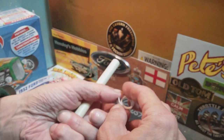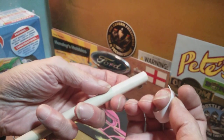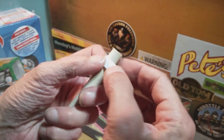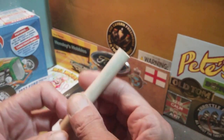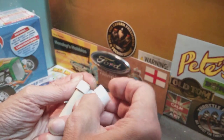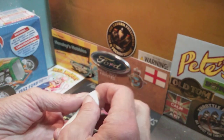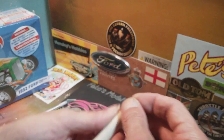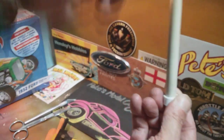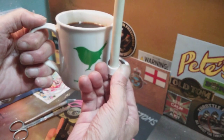So I started with the centre section and formed it around to a cutting point where I've got the whole circumference — which brings us back to this piece of pipe. I slowly cut a strip: this is 8mm wide by 0.75 of a millimetre. And I just started to slowly work my way around there, getting it as neat and as tight as possible to that pipe. Then I held it on with masking tape. Now I did four bands of this — banded one, taped it on, then moved a little bit along. The idea was not to extend any further than your average coffee mug, if you want to get them stacked to that sort of height.